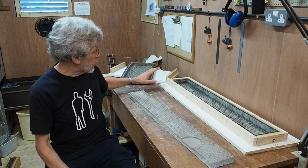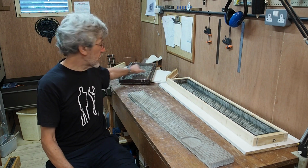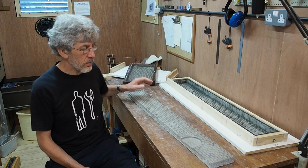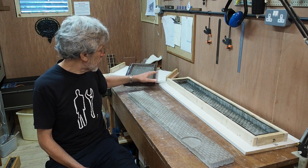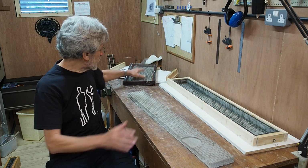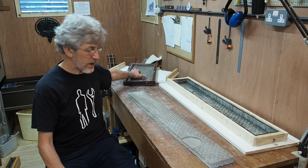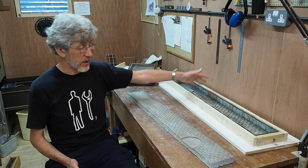At the point where I poured this one, I also poured one of the block walling sections, and treated them identically. It's the same mix, same treatment, same level of demoulding agent on it, and it was so much easier to get out of the soft rubber than even this well established firmer one. I mean, that came out fine, but it was just easier with this one.